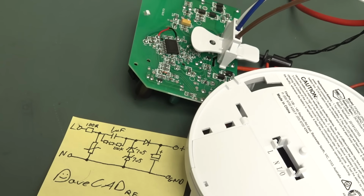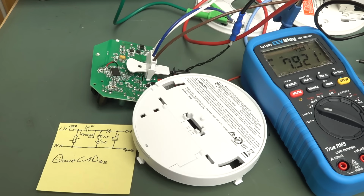So that's just lazy and cheap design, and they just didn't care. And of course, 79 milliamps might not sound like a lot, but when you have millions, tens of millions, hundreds of millions of these sort of things out there, it makes a huge difference, especially given the poor power factor. That current has got to come from the generation system. And you've got I squared R losses in all of that, and it adds up.